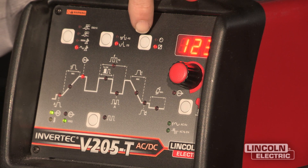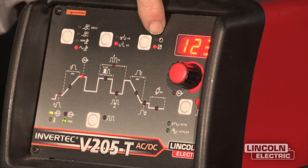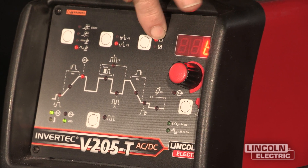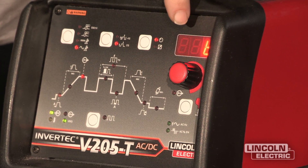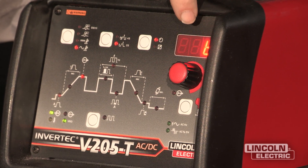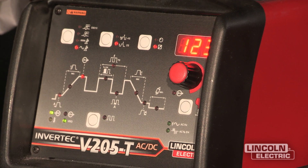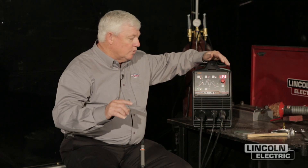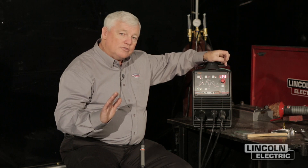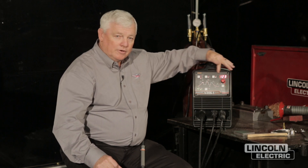So I move over here and there are two little cartoons. One of them at the top means that if you have the red light at the top, you're going to get whatever is on that amperage control right here — so it says 6 amps, that's all you're going to get. If I toggle it down, there's a variable control symbol, meaning my foot control is going to give me from 6 amps up to 123 amps. Those are the primary functions on it.